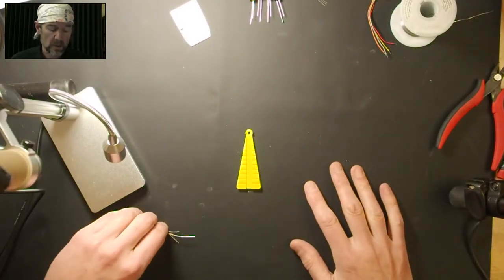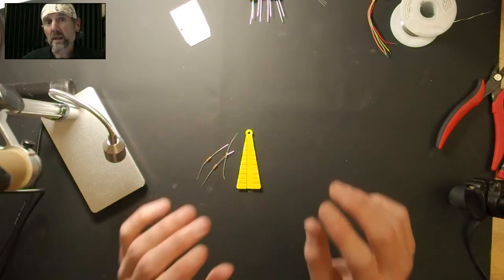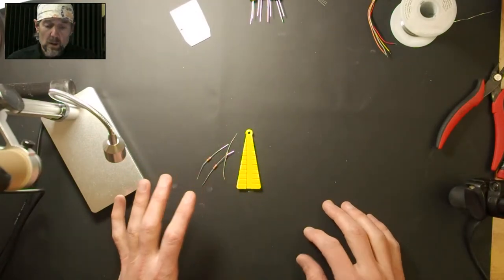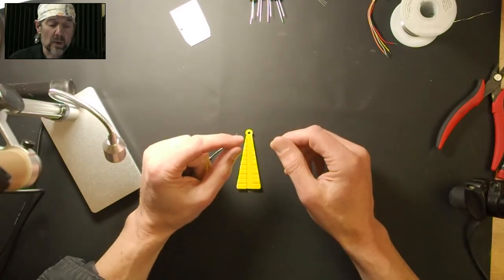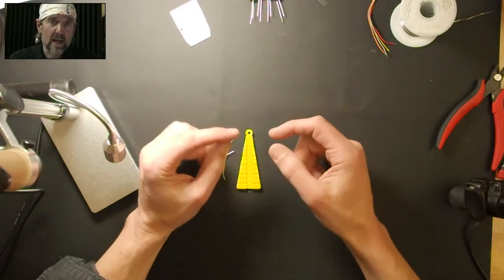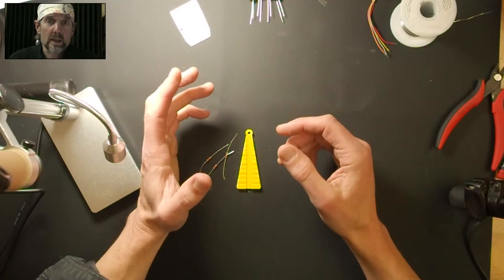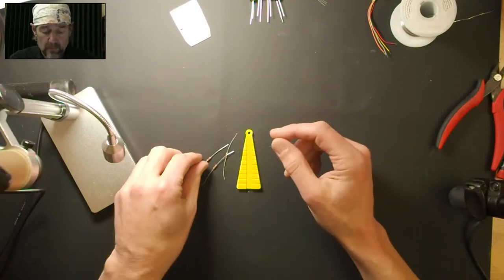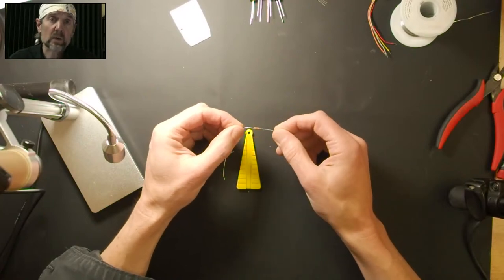What can you do? So let's talk about a DIY technique. Probably anything you ever build is going to have resistors in it. It's one of the key passive components of any circuit. And we use a brand called Dale. And we like these for a couple of reasons. One is they're low noise, so 50 parts per million thermal noise.